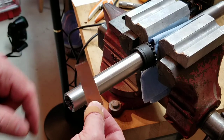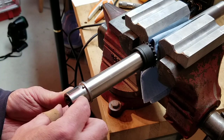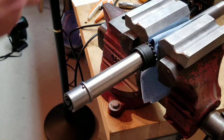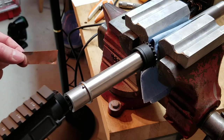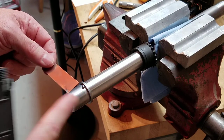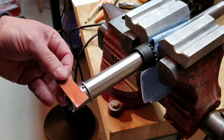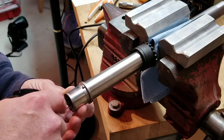Basically, you use a pair of scissors to cut out a section of the stainless steel shim stock - it's just wafer thin. What you do is take it and wrap it around the barrel extension like that, then slide the upper receiver on there. That just basically takes up the gap. The length of the piece of shim stock really depends on how loosely the system fits. If it's really loose you might need a longer piece - if it's a home build or really out of whack you might need a full wrap. Typically I use about three-quarters of a wrap, and I try to cut it so it fits properly between the end of the barrel extension and the index pin.